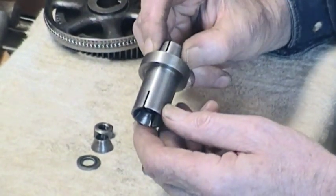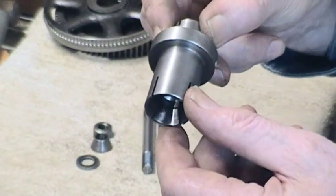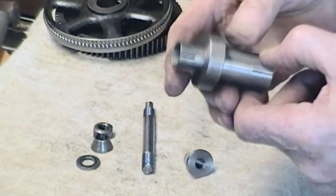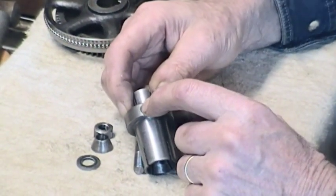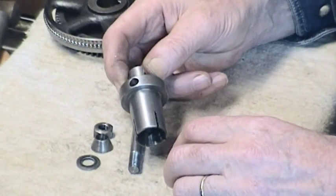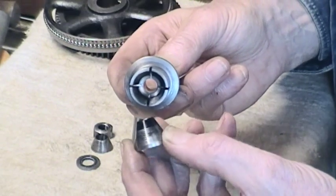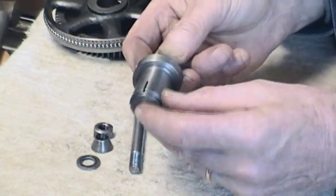So what we've got is this piece, machined from solid. It has — you can actually see — slitting saw cuts at both ends. There's a hole in the side for putting in a piece of bar for tightening. Like most expanders, we've got a cone end piece which is bored and tapped, which goes in that end.